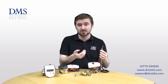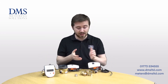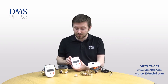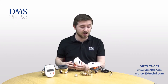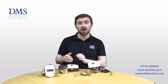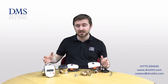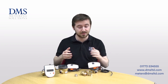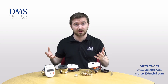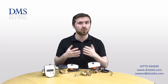All o-ring seals are available as spares but are also supplied as standard with every single one of the meters. The communication outputs these meters can utilise: they have the standard LCD display so you can just take a direct reading off the meter, but they also come with pulsed outputs for communication to a BMS. M-Bus is also available as part of a network. Wireless capability is also available in the form of either the Supercom radio, which is a Sontex only branded wireless system, or these meters can actually be supplied with wireless M-Bus — which is very new to the market but is becoming much more popular and sought after — basically using the same M-Bus frames but in a wireless format to remove the necessary installation costs of wires and provide a much more automated system.